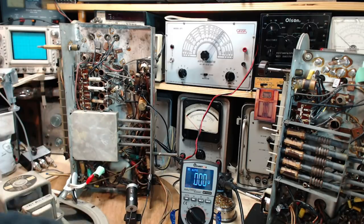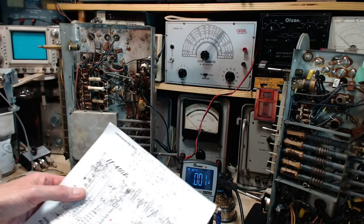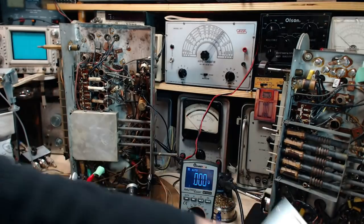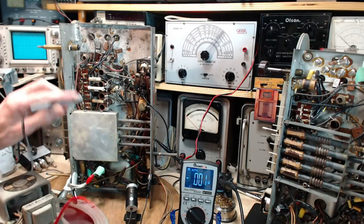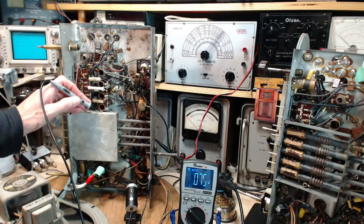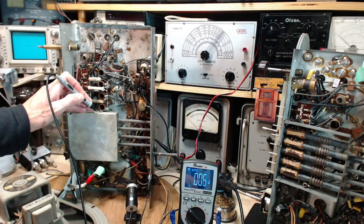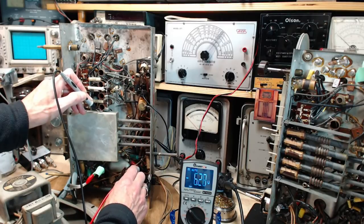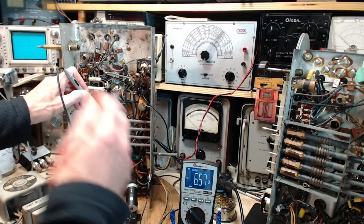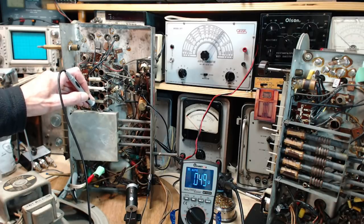Let's pump up the full, read the plate voltage first. And we'll see what this grid is dealing with. Plate voltage is going to be on pin number 3. Pin number 3. I better get this on the right polarity here. Wait a minute. I had these leads reversed. That negative was a positive. What? Okay, no, I didn't have them reversed. Whew. If you had plus 6 on your grid, it's time to shut the radio down and fix something right away.